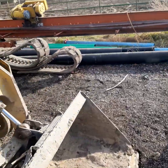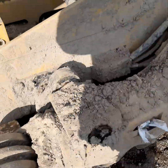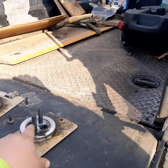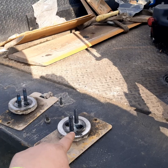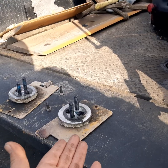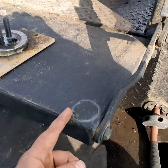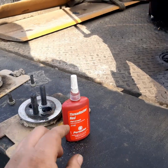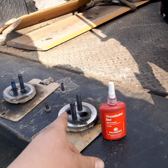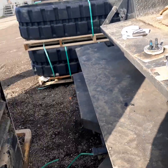As it goes back on, get your hose all put on and you'll slide your track frame back on. I highly advise you to use red loctite - yes, red loctite - and do not over-torque these. I usually hit them with a half-inch impact; you just want them snug, but you don't want to keep going because they will shear off in that pin. I've had that happen. I don't know the actual torque spec, but you want them tight so they don't come loose and use loctite. I use red loctite, high strength. Make sure you clean the grease off these caps and install them back - you've got two caps on each side and you'll be good.